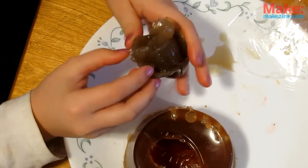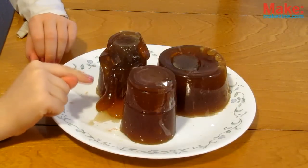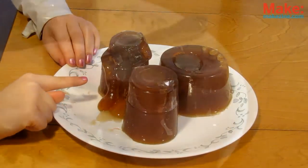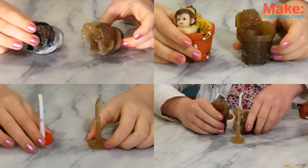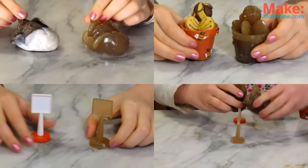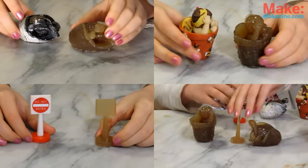Molding and casting can be pretty complicated. In the words of my favorite mold maker and MythBuster, Adam Savage: failure is always an option. The thin walls of our bumblebee mold melted from the exothermic reaction of the resin hardening — luckily, not before the composite mold did its job. Bubbles and bad pores are most common and will get easier to avoid with practice. Now that it's done, you can sand or paint your resin, or reuse your molds and try other casting compounds like plaster or even concrete. The world is yours to clone!